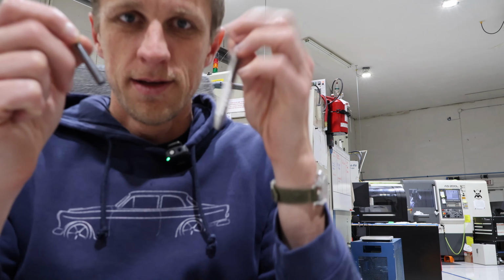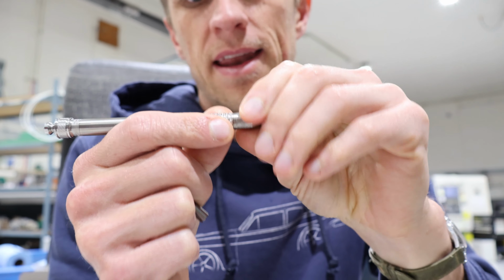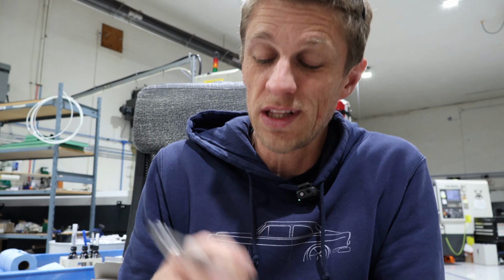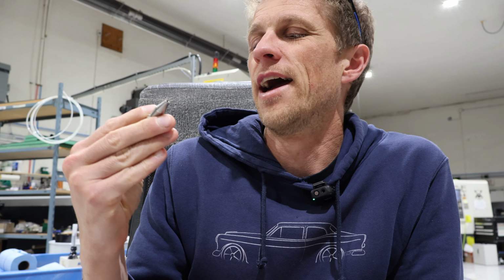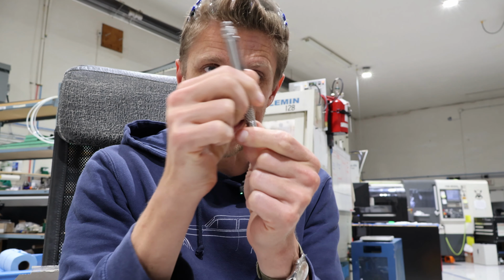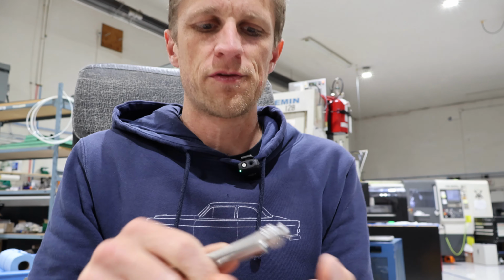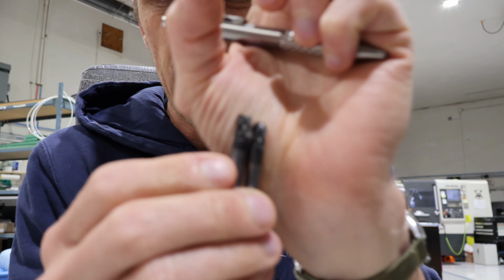All right, so this being the very first Saga from us anyway that has ever had a pattern, I am absolutely loving it. I think it's really cool, feels amazing, looks amazing, writes amazing, and we're definitely onto something here. The cool thing with the Willemin is because you have the B axis that can rotate down at 90 degrees, you can do some really crazy stuff with different end mills. So for example, I have two simple end mills here, a quarter inch ball and a quarter inch flat end mill,